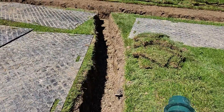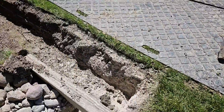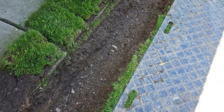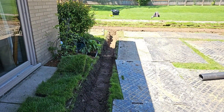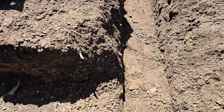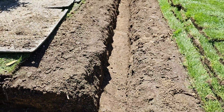You can really see it — it's textbook what the guys have done. Right here we're probably ten inches deep; it's shallow. Then right here they just slope it right out. We're going against grade, remember that. So again, this branch to the main trunk line — slope it. You can see how deep we are over here. The guys did a really nice job; all the details have been met.